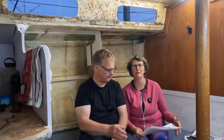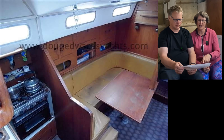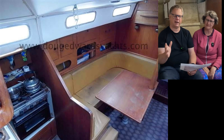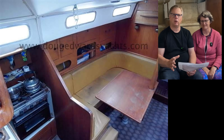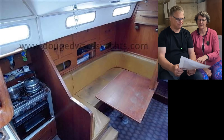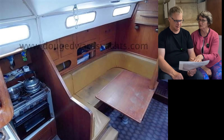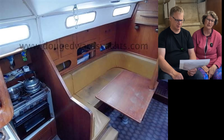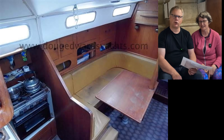Let's look at the pictures. We've got what it was like originally, which shows all the beautiful woodwork and helps you see there was a very small galley — basically just a sink and a cooker and nothing else. The surveyor condemned all the gas: the cooker and burners were falling apart, the pipework was corroded and dangerous right back to where the gas bottles were, so the whole lot was condemned.